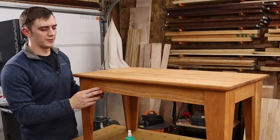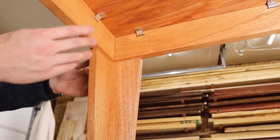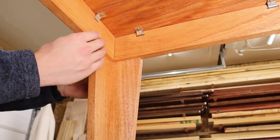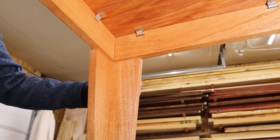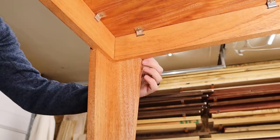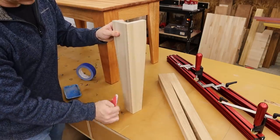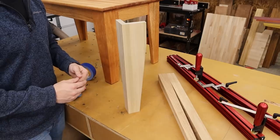While that leg is drying, I want to go over how I attached the aprons to this coffee table. I really like this leg style because it gives you a ton of surface area to attach aprons. I cut a half-lap in all of my aprons for lots of glue surface. You could also run the piece completely behind the leg and use screws, but I didn't like the three-quarter inch reveal that gave on the outside. With the half-lap I cut that reveal in half to three-eighths, which made it look a little lighter. After about an hour I took the tape off the glue joint, sanded the seam, and the joint came out perfect. This tapered leg is my favorite out of the three.